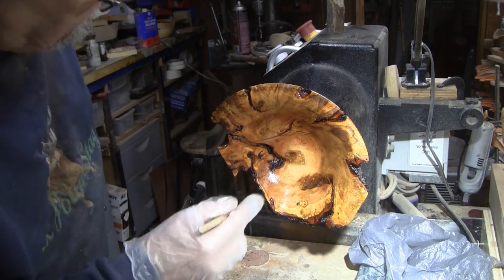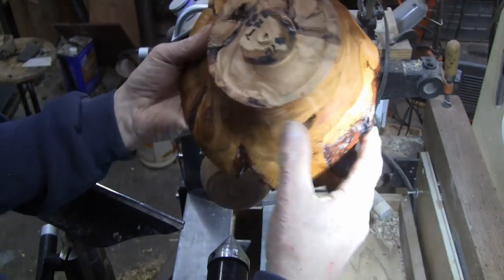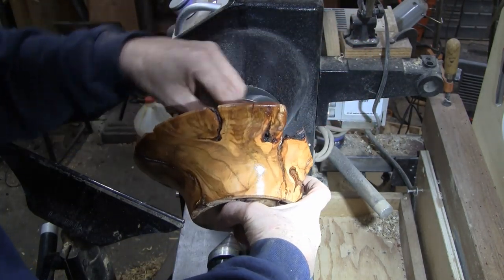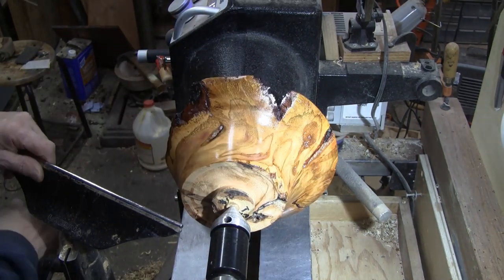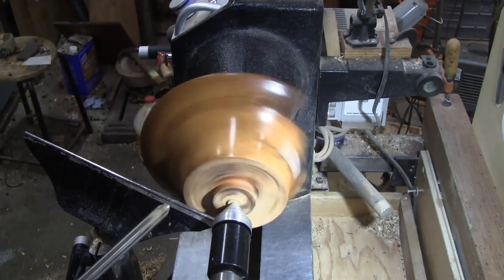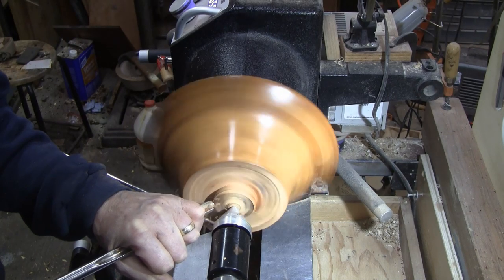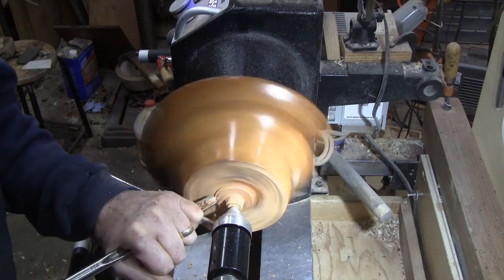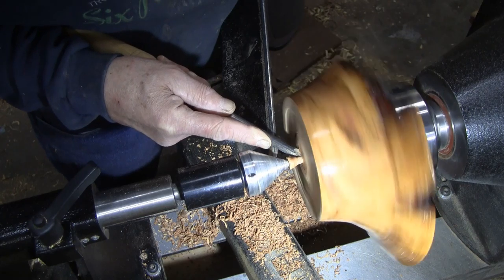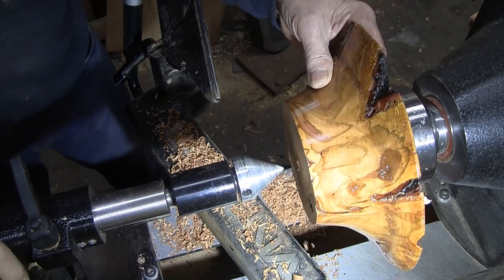Hopefully removing the tenon will be uneventful. I've got to cut the tenon off — seems like a simple thing to do. This wall is really thin now because of putting pieces back in and returning them. But let's just go ahead and give it a try. Got a block in my chuck and a piece of padded material. Let's see how round that might turn. It's reasonably good — about 640 RPMs. That was pretty risky, but what can go wrong now?